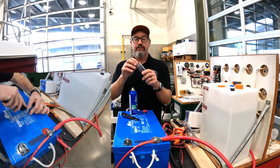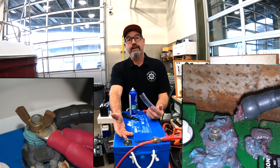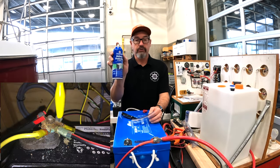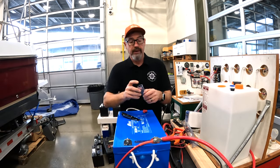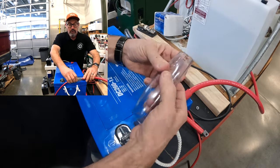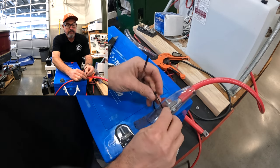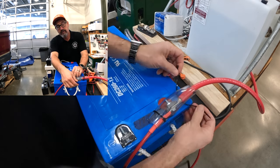One of the benefits of this is it's clear. You always want to keep an eye on the battery terminals — make sure they're not turning green and fuzzy or anything going on. We've seen a lot of crazy stuff there. So you can hit it with a corrosion block or a battery protector first. Then all you do is simply pop this piece of clear hose over the connection and grab yourself a couple of tie wraps — a little zip tie action. Put two zip ties and that'll secure it in place so it doesn't fall off.